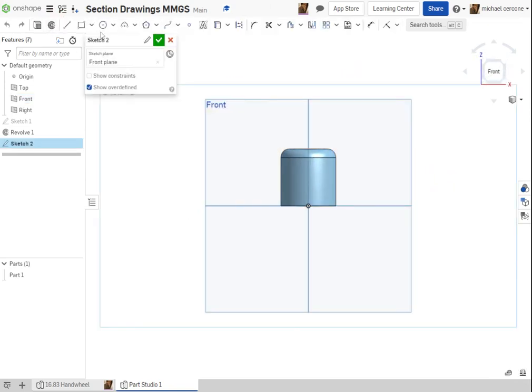So I'll start a sketch, and what I need is a circle, which is the handwheel portion, diameter 20. This is going to end up being revolved, so I need a construction line that's in line with this. And the height of it is 50, so that lowers that. And now I need another diameter dimension. So again, I selected the center, went to the axis, moved to the opposite side, and I'm going to type in 140. Now I can take this and revolve.